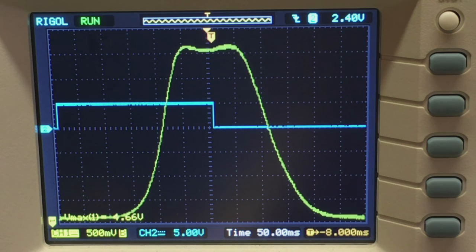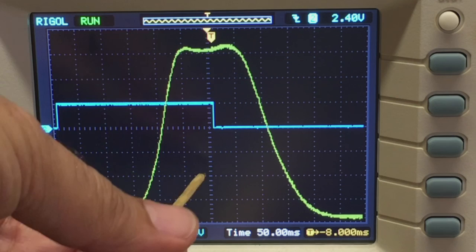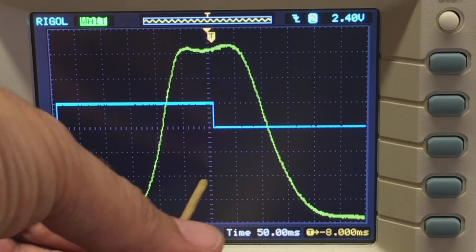Let's have a look at this on a different scale. I'm going to reduce the width of the sweep even further. At the moment, I've got 300 kilohertz here. I'm going to make this 20 kilohertz per division. So 120 that way will be 10.7, 10.6, 10.58.